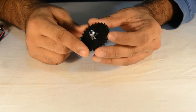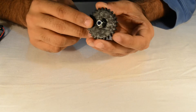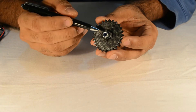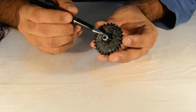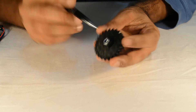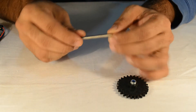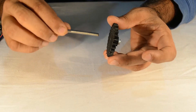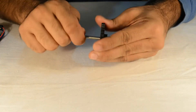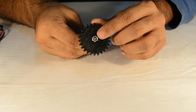Now we need to prepare the large gear. Use one M5 nylon locking nut and insert it into the front portion of the drive gear. You might need some force to insert this nut into the space provided on the drive gear. Be careful not to crush the plastic part while inserting this nut. Now take the 56mm long M5 threaded rod, keep the flat portion away from the main big gear, and insert and thread it into the large gear. Ensure that the rod is tightened and flush with the nylon locking nut.